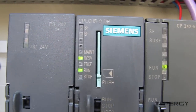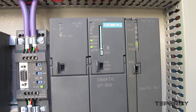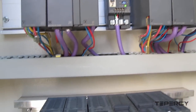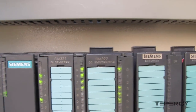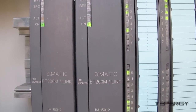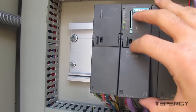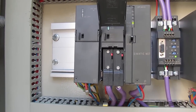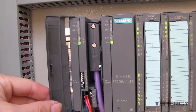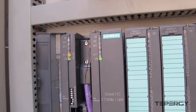As you can see, both CPUs are currently in run mode. You may be wondering how do we know which one is the master. This can easily be determined by the LED light on the IMs. There is an active LED light on each one of these IMs. The active LED of the left side IM in the second rack is on, and we have the same situation in the third rack. This indicates that PLC-A is our master. This lighting configuration means that the data of the modules installed on the second rack is transferring to PLC-A using this IM, and the data of the modules installed on the third rack is transferring in the same way to PLC-A using this IM.